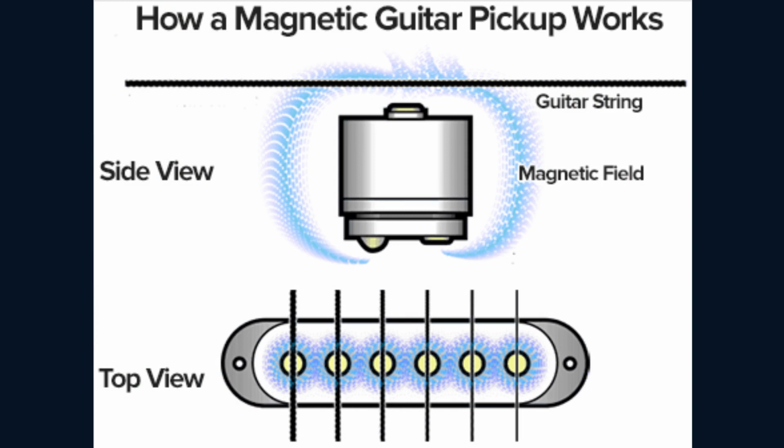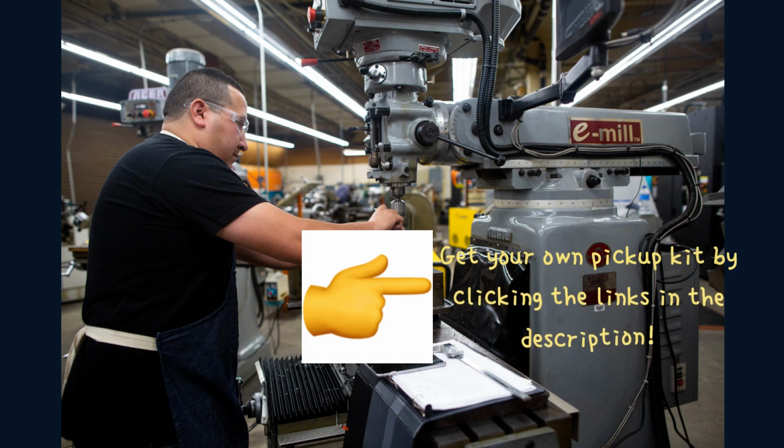There are a few distinctive basic mechanisms that are involved in signal production. The magnetic field of the pickup is a crucial component of the equation from the first angle. Additionally, signal is produced by the movement of the pickup's associated field lines. The pickup does not need to have its own magnetic field in the second mechanism, where the vibrating magnet is the string itself, as long as the string is magnetized. All these details will aid you in creating a technically sound pickup if you're thinking of manufacturing your own pickup magnet. If you have any interest in guitars, the material is still worth learning, even if you do not intend to manufacture your own pickups.